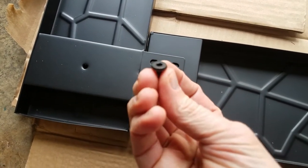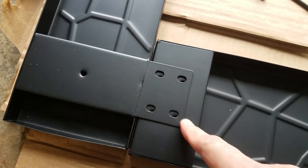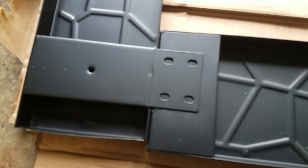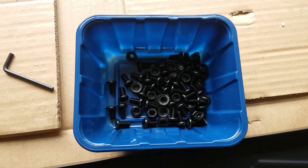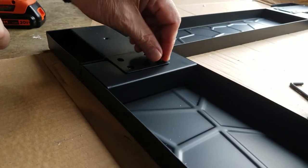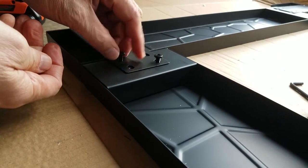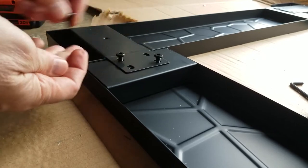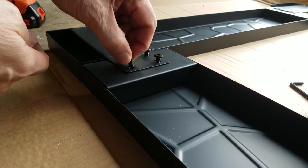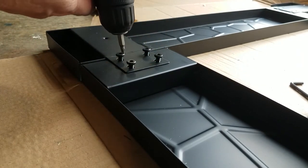We're going to use this bolt — it has its own key — to attach four bolts to each section. I'm going to use a T25 to speed the process up. I find it useful to pour all the parts into a container so they're easy to reach. We finger-thread each of the bolts because if you try using a driver at this point you could cross-thread, and that would be a bad thing. This ensures they catch correctly before you apply any power.